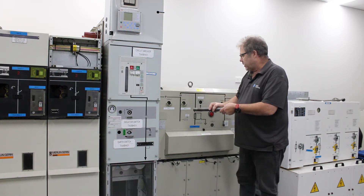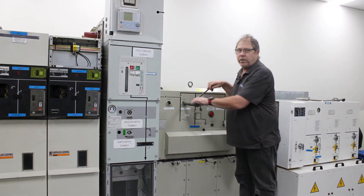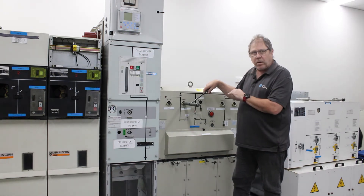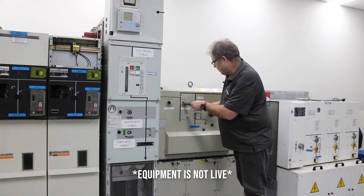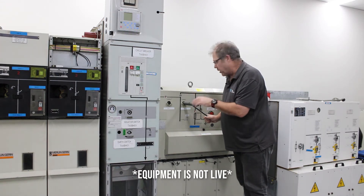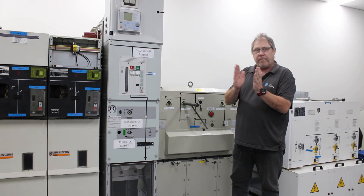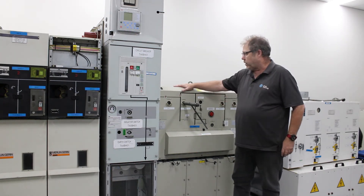To demonstrate this, we've got a switch which is open at the moment. If I attempt to close that switch slowly, what's going to happen is that if the switch operates slowly you're going to get an arc and quite possibly destroy the switchgear, but because of the way they are designed that's not possible to do. To demonstrate that I'm going to attempt to close it slowly. You'll get to a point where it will just take off on its own and slam shut. So there is no possible way of bringing that switch blade to the live bus at a slow speed which can create a large and uncontrolled arc. That's what a high voltage switch does.